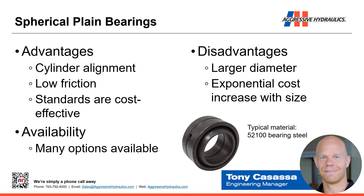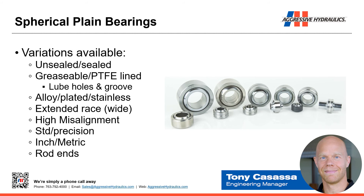Disadvantages: they get bigger because you have the inner and outer races instead of just one piece, so they add more dead length — which can be an issue if the customer has restricted retracted length relative to stroke. They also get expensive as they get bigger. Small ones — half-inch, one-inch — are common with lots of options available. Above two inches, they start to get expensive and have fewer options. Typical material is 52100 bearing steel, though there are lots of options available.